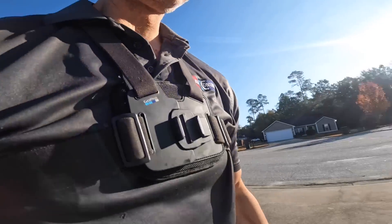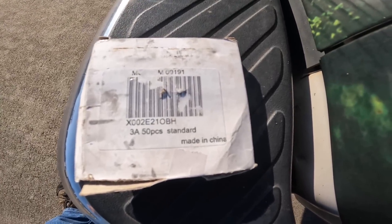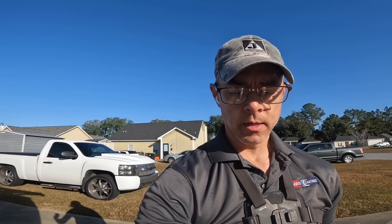Alright, so that one just turned out to be a faulty fuse. It was not an Eatons fuse — it was one of these made-in-China, 50-in-a-box ones. When I bought them, my supply houses were having trouble getting any in stock, so I just ordered a hundred of them off Amazon. That's actually the second time I found one where the fuse is not blown but it's not allowing voltage to pass. So now I'm gonna go look and see if I can get some more of those Eatons fuses — those cheap ones may have been inexpensive but they ain't worth it. Thanks for watching guys and I'll catch you on the next one.